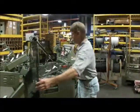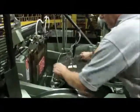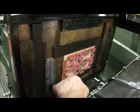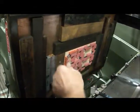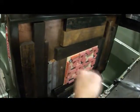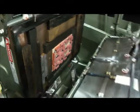The die itself is a new die. The only thing I've changed is there was no ejection rubber on the outside edge of the top-left business card. Because there wasn't any ejection rubber on the outside, as it die cut through, the matrix on the outside edge would actually lift over the card and the card would fall out.